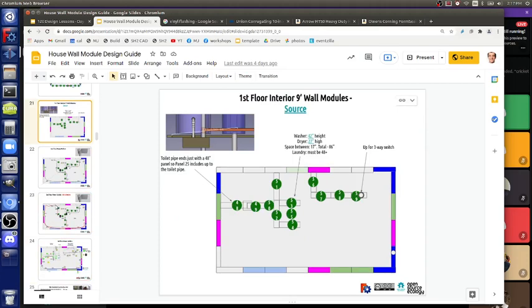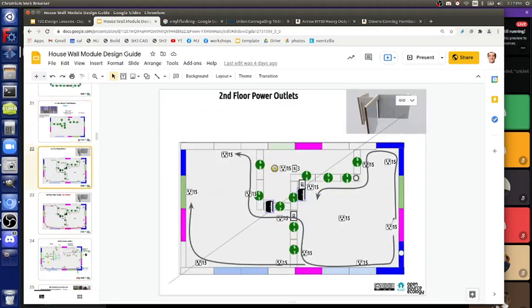And here is a super rudimentary electrical plan. So this module right here, module number one, ends up having the breaker panel. That's inside the carport. It's still exterior plywood, but we can probably attach it on the side, but we have to have a hole where the wires go through the wall. So the first panel needs a hole that's actually defined already. From there, you're running all these wires just like this. Every outlet-looking thing is an outlet. Those modules that you see in this plan correspond to the actual module numbers, and we're putting an outlet into all those panels. That's the second floor.